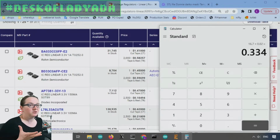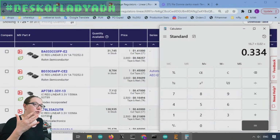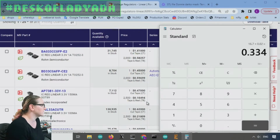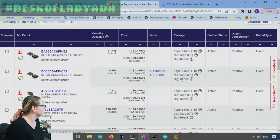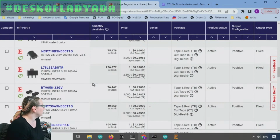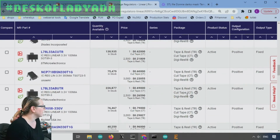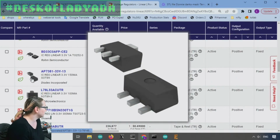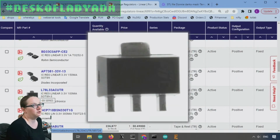For this design, I'm going to just warn people, hey, I don't need more than 5 to 10 milliamps to drive the chip itself. But if you want to use that for other circuitry, and you've got the 20 volts output, people have to realize that I'm not going to be able to get that much current out of it. I think that's fine as long as I document it. I'm going to still stick with a SOT-23-5, although I think I might do some more math and verify I don't need a SOT-89.